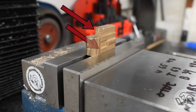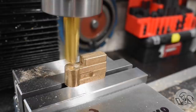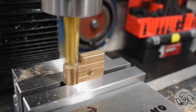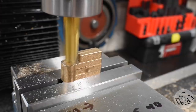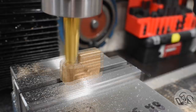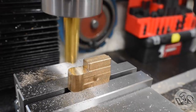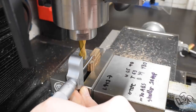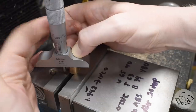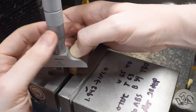I'm using a depth micrometer to reference the depth of that shoulder on X to the edge of the vise, and then I can use that to match the shoulder on this side and bring this side down to the same height, just as I did before, all the way around. With that surface cleaned up I can bring the shoulder into the same depth, double-checking from the same fixed jaw. I'm also checking how far down I need to go, referencing down to the top of the vise jaw since I've got a machined surface sitting on the top of that jaw.